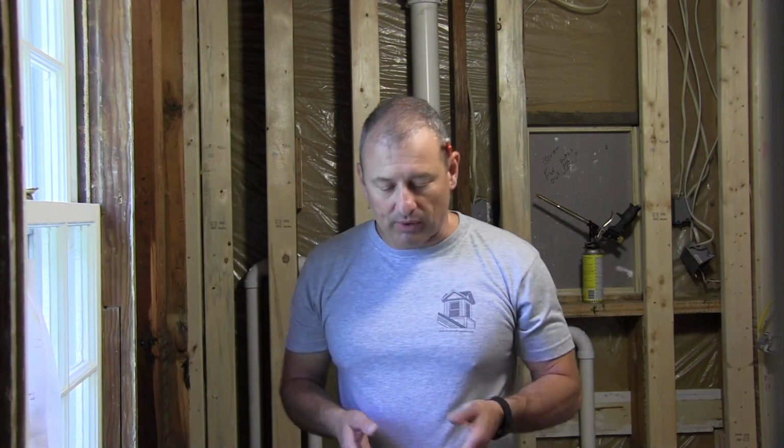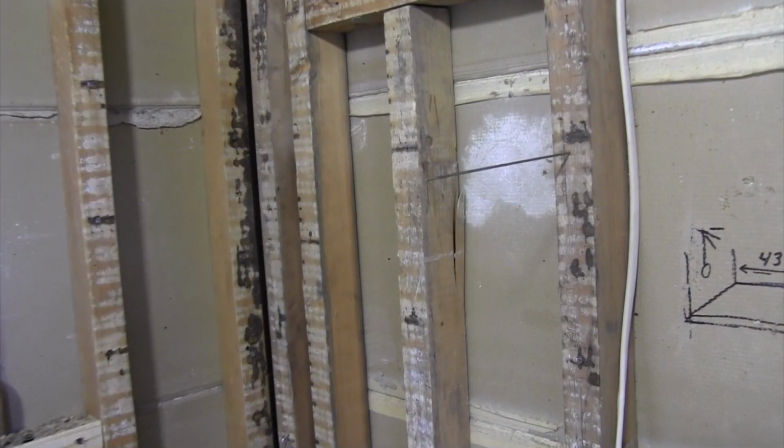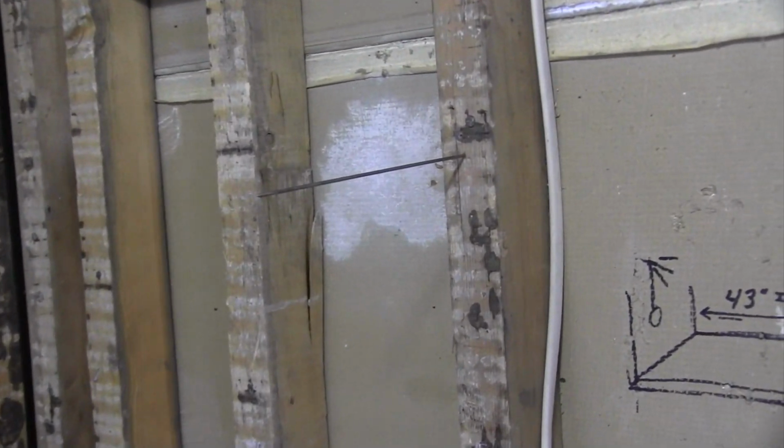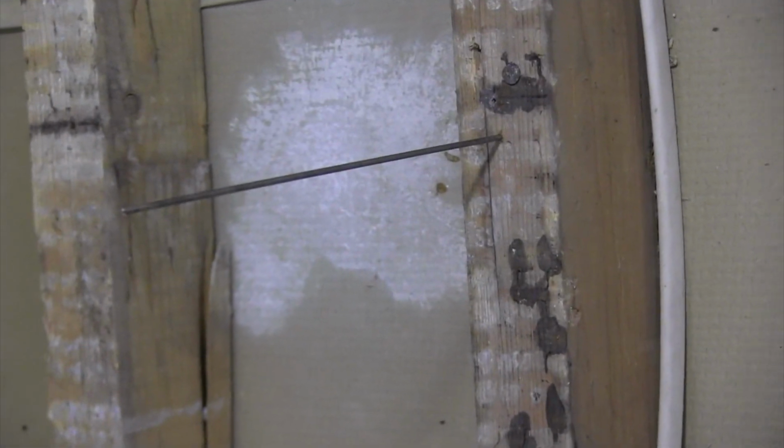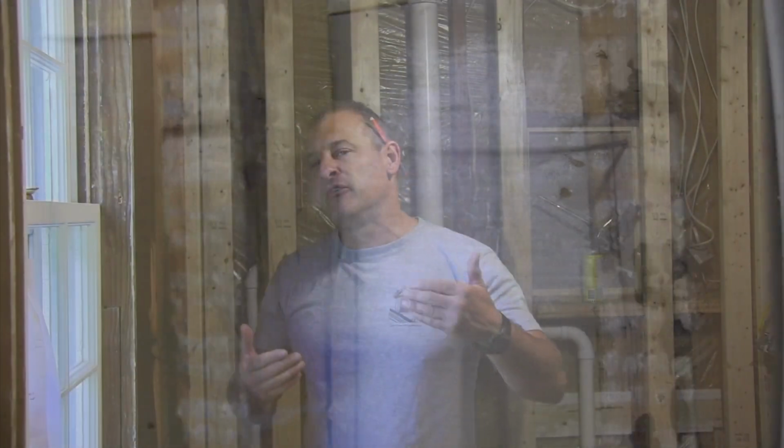I want to share with you a neat trick that I learned from HVAC installers a long time ago. This tip is useful when you find yourself needing to drill a hole through a wall or a ceiling, a floor, and you're trying to do the layout, anywhere where maybe you can't see the other side or easily walk around to lay it out. So it's a probe. It's basically a probe tip. And it saves considerable time in layout and considerable time with filling or patching exploratory holes later.